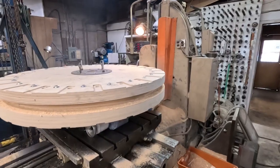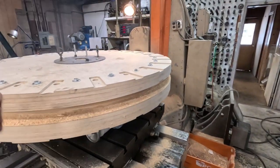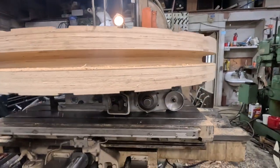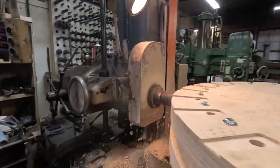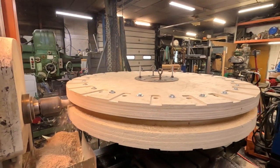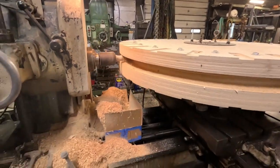Let me tell you what we're up to. This is getting machined into a bending die for some aluminum extrusion. What I've got going on is this is really designed for rapid traverse on this power feed, so I've got it hooked up to a variable frequency drive, dialed down to about 15 hertz — that's as slow as I could get it to run reliably. I've got a pipe wrench on the switch because it's normally just for jogging; I'm just letting her sit there and spin. We are stepping out and up each pass around, creating a unique compound curve profile. We've got 80 passes to do to get this whole thing done, and so far it's going pretty good — other than we're making a huge stinking mess.